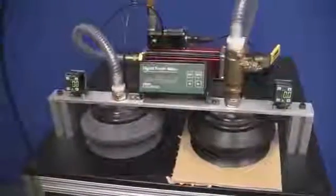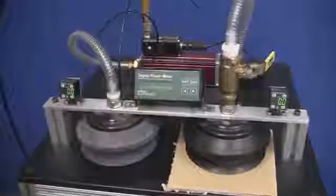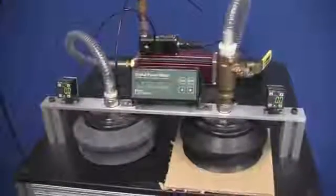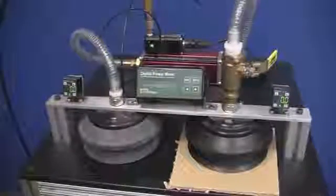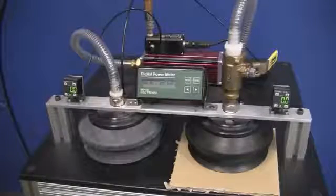What this illustrates is that the true energy consumption of this type of pump is going to be determined by how it's run. It's very application specific and application dependent and shouldn't be an assumed constant that can be estimated just from the pump specs.